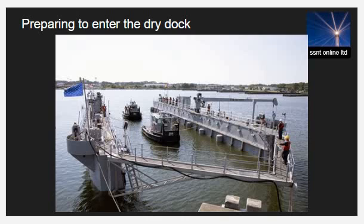If the floating dock is used, the ship's movement will depend on the docking master's requirements and the vessel's condition. If the vessel is immobilized due to an accident, the floating dock will move towards it, and if the vessel is functioning correctly, it may propel inside the dock. Once the ship enters the dry dock, it is moored to the dock.